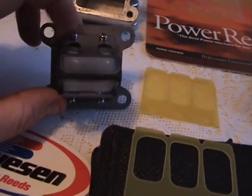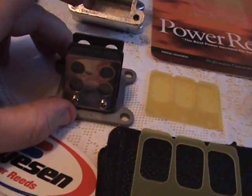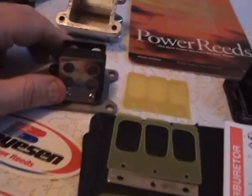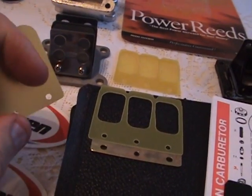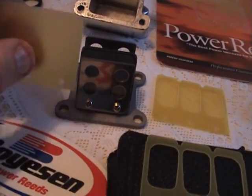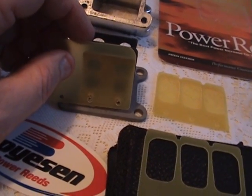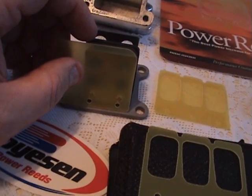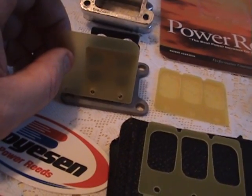With this overlay on top and fitted to the cage, it'll work fine. Now I've tried to do that with the smaller two-stage reed — this is another CT type that fits in the cage. It's dual stage, and what I found with this one is that you can't use the inner part because it won't fit; it's just not cut right. But for the outer part, I could take off the outer flat part of the reed and use the outer part as the two-part reed. I can cut it down and the holes will almost fit perfectly.